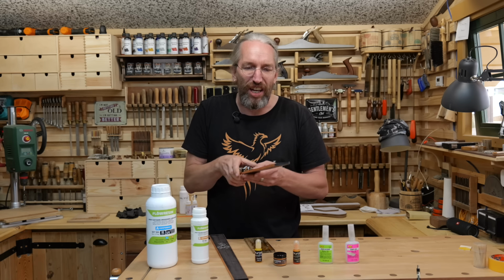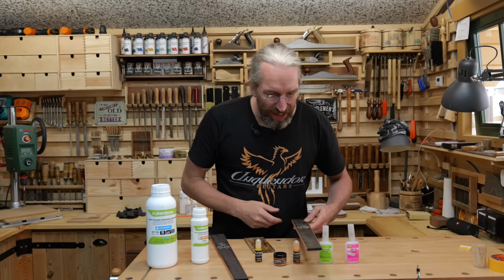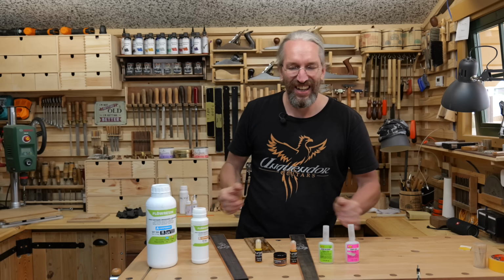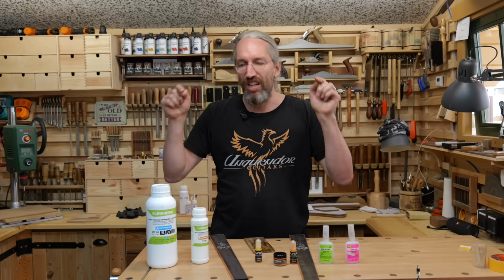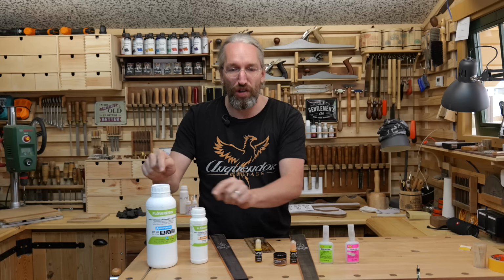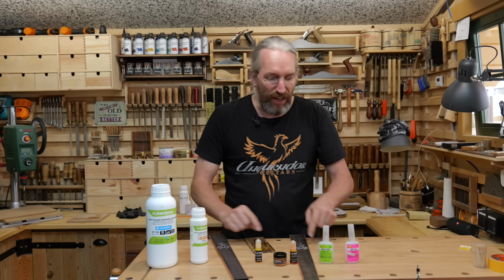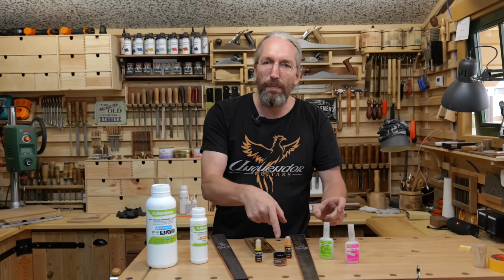And that means that I can just finish this fretboard and finally continue to work on the neck and the rest of this guitar. So let me set up a workspace, cover my workbench in a sheet of MDF so it won't get stained, and start first by doing an epoxy pour on the Obsidian Ebony fretboard, and then do a regular fill with stained CA glue and mica pigment on the Ebony fretboard.